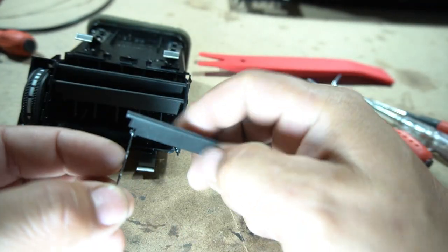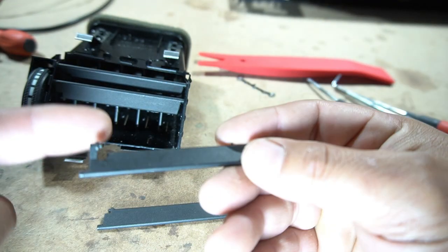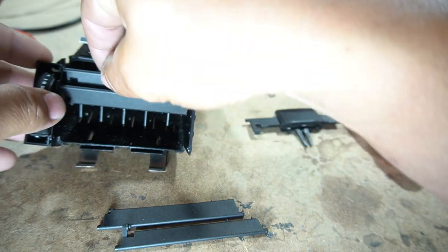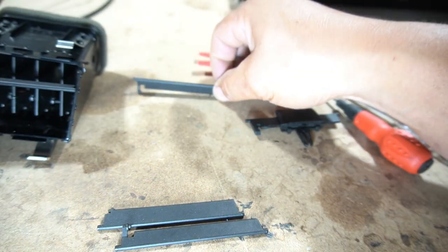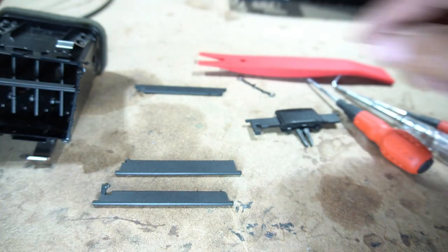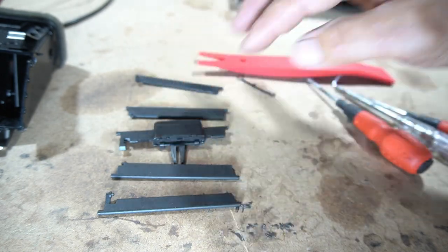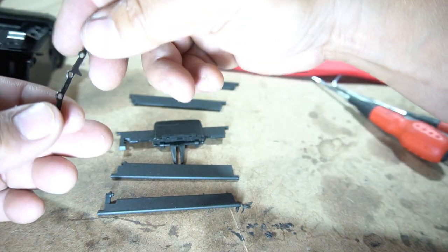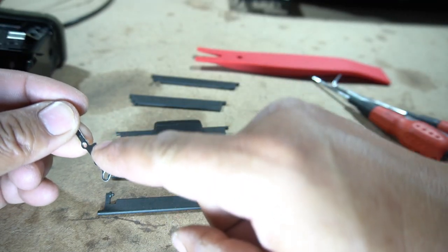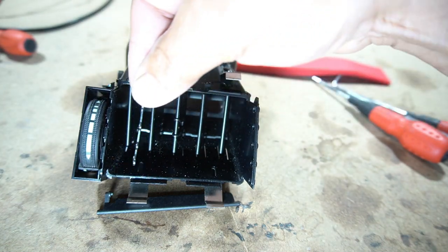You need to take note of where the louvers sit because they only go on in a certain way. This tab here points up — this one will be on the bottom. And then there's another one on the top that curves down, so that would go on top. The middle one goes in between. Three of the louvers clip in one way and the other two clip in the other way — that makes sure the bracket stays straight. When you install it, make sure this little tab sits on the inside. Your bracket would sit in like that.